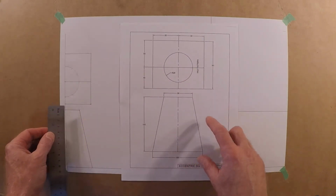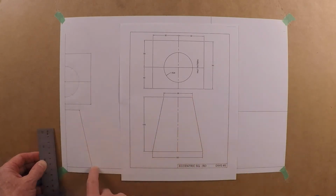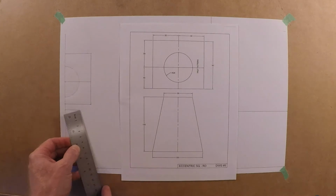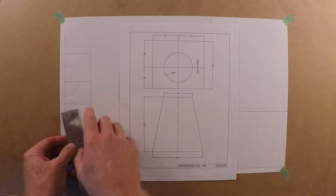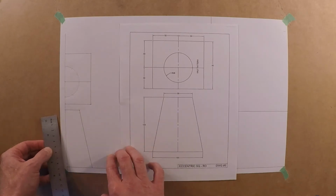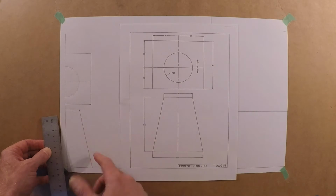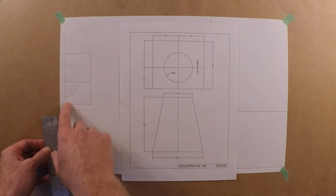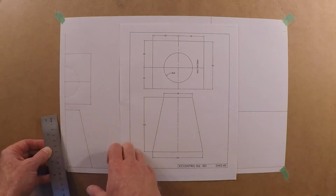So we only need the front view here really just for the height. That's really all it's for. And I guess this length over here is a true length, but we can put that into the true length diagram even just using that. So anyway, if you knew what the height was, really I guess you could eliminate this altogether. So really what you need is this top view over here, because obviously we're just going to get our offsets for building our little triangles in there.